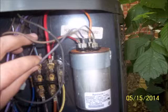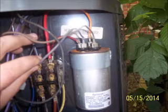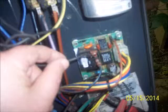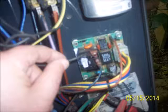Okay, I took the motor off the air conditioner unit, and I took some photos here just so I knew where the wires would go back on. Now, if you have a look, I'm feeling the wires between where it's connected into the tube up the top there, and where they run, which is down to the bottom. There might be very many duplicate photos on here, but it gives you an idea how to trace wires by going from the original source and then working out where the colours go to for when you reconnect them again.